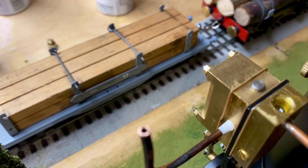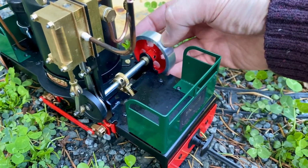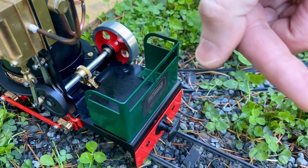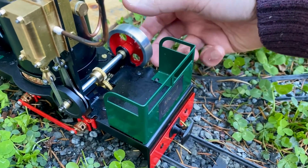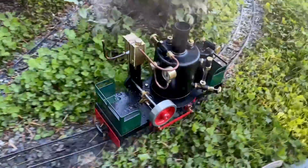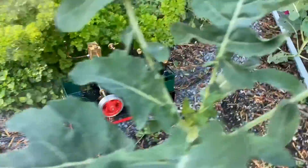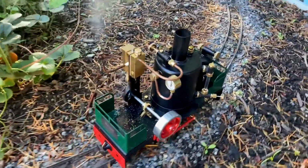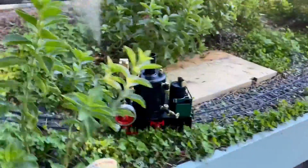It's very beneficial. While that's heating up, I'll just let you know it's got a slip-eccentric gear, so if you turn it this way, it sets the slip-eccentrics for that direction, and you spin it, and it should go. For the reverse, reset the slip-eccentric the other way, spin it that way, and it should go. Like any new engine, it's got to bed in. It's going to run a little rough at first, till all the gears mesh well, the whole nine yards. That's called bedding in. So when you have a new engine, it's not going to run as well as it's going to run. But I'm really pleased with my chimney.